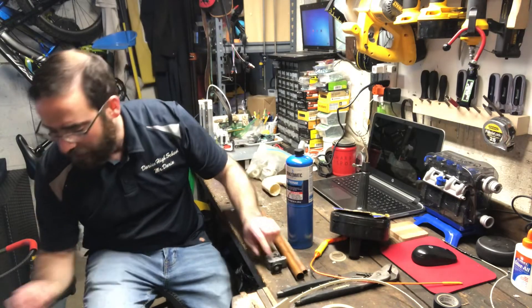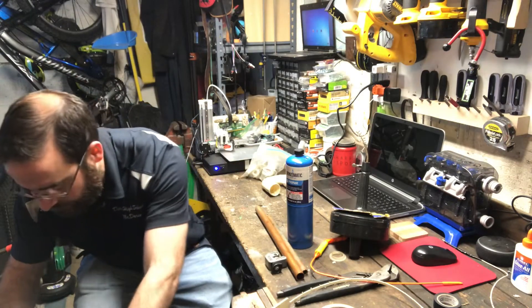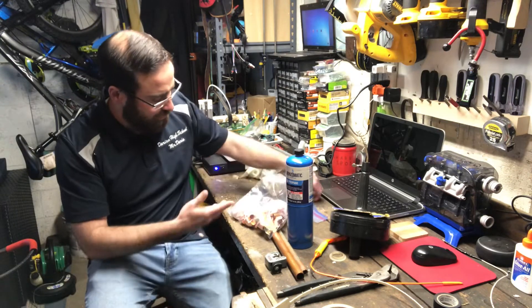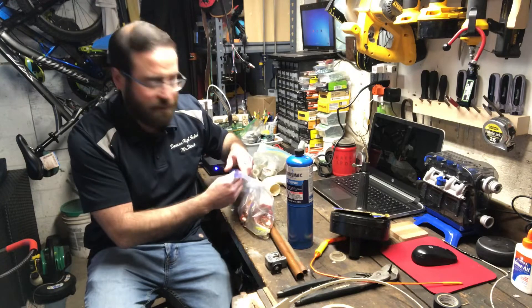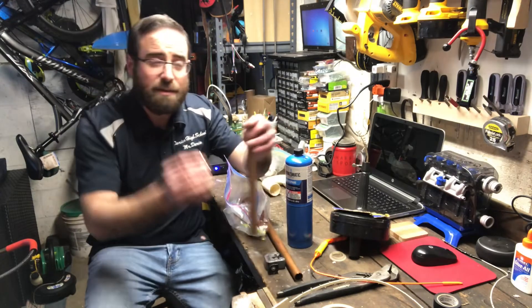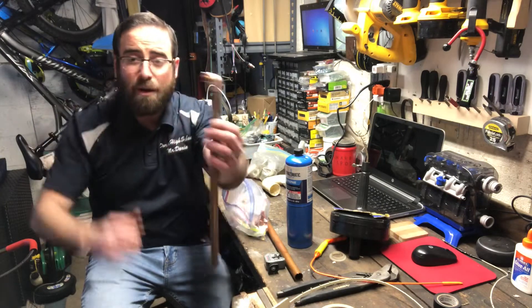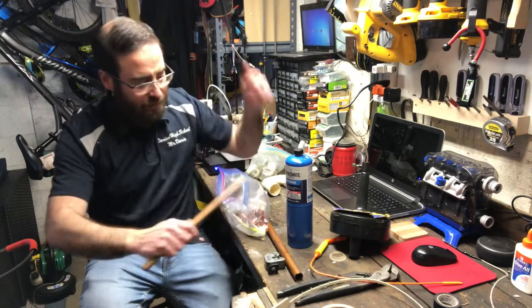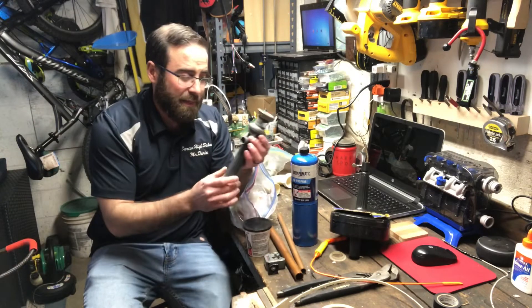This cutter will cut copper pipe. I also have extra copper fittings — every time I do a job I buy a couple of parts and it's nice to hold on to them. If I needed to add pipe and make an elbow to adjust direction, I would clean it and use the torch to sweat that joint together.